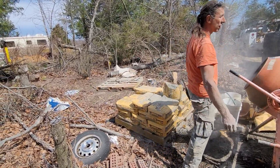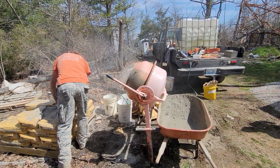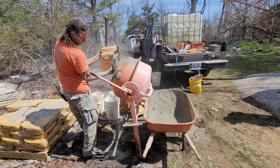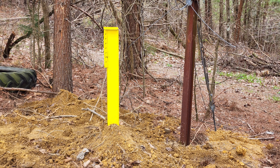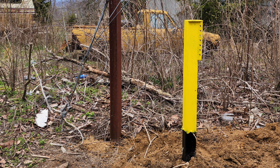Talking to Josh as he mixes more concrete, we can see we're already off one pallet and onto the last one — so we're starting to fill up the last hole. Here's the first post as it currently sits. We dug that hole by hand, and you can see the old I-beam behind it that had a hole through it — incredibly poor condition. We have yellow painted on top for better visibility and will go back and paint the lower portion yellow above ground as well. Here on the south side of the tower the yellow post is pointing up from the ground with the old post behind it. You can also see the anchor holes on the left side. The third location is similarly done, and this pretty much finalizes getting all three posts in the ground.